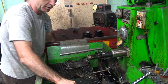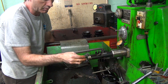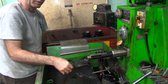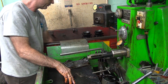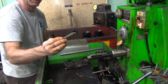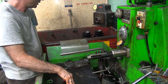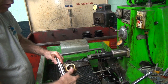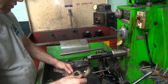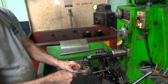Cool the rod down over here in the tank. I'm going to swap out the stone. Just change to a finer stone. I think this stone here is like a 180 or 220 grit. This stone we're going to drop down to probably in the 300 grit area, and our final one will be in the 400 to 500 grit area.